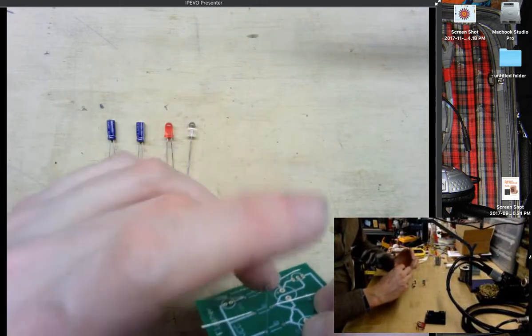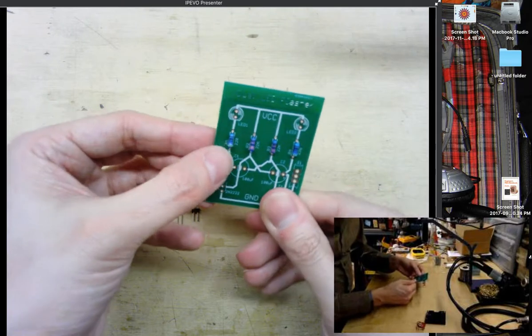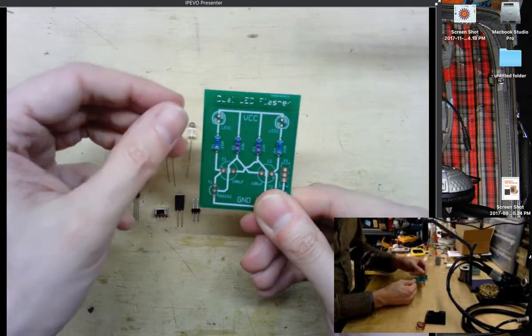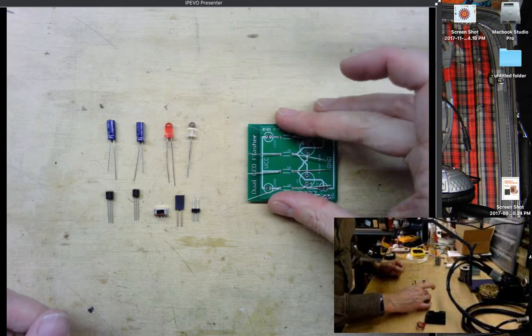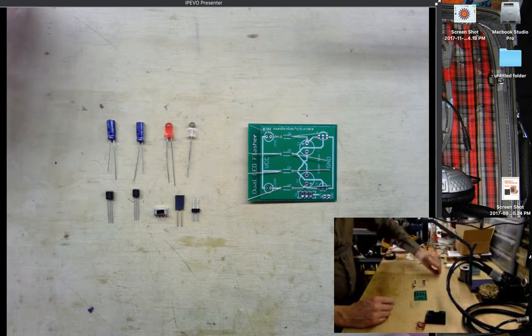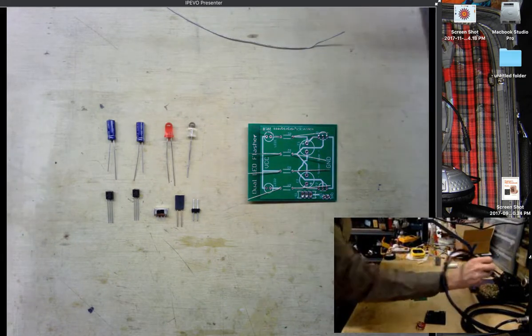All right. Now at this point, it would be easy enough to place more components into the circuit board and then solder, but I'm an advocate for taking your time, working your way steadily through any circuit board build. And so now that I have these resistors, really the lowest sitting components, already on the board, I think I'll pull out my soldering iron, get my solder ready here, and actually attach these resistors to the board.